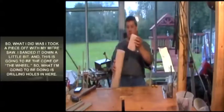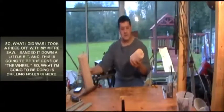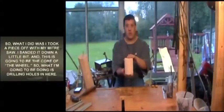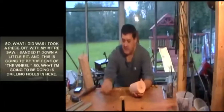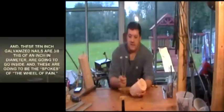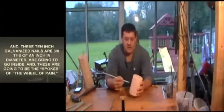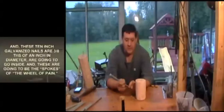So what I did was I took a piece off with my miter saw, I sanded it down a little bit, and this is going to be the core of the wheel. So what I'm going to be doing is drilling holes in here, and these 10-inch galvanized nails, 3/8 of an inch in diameter, are going to go inside, and these are going to be the spokes of the Wheel of Pain.